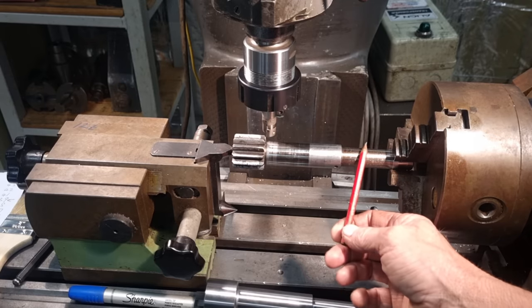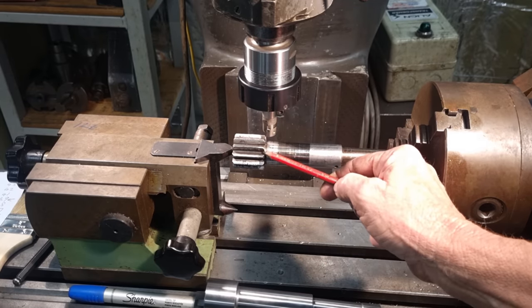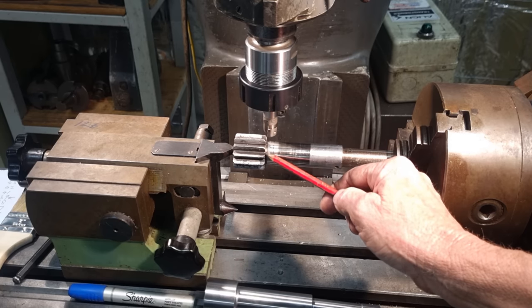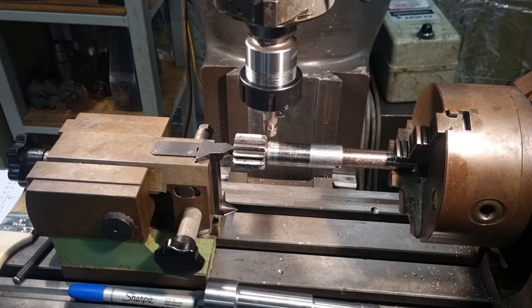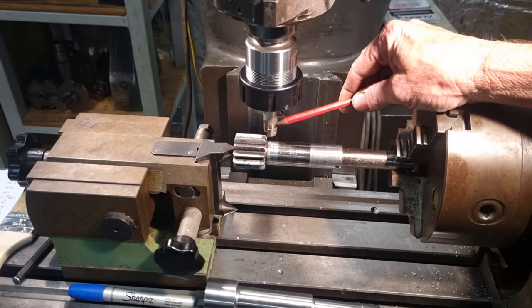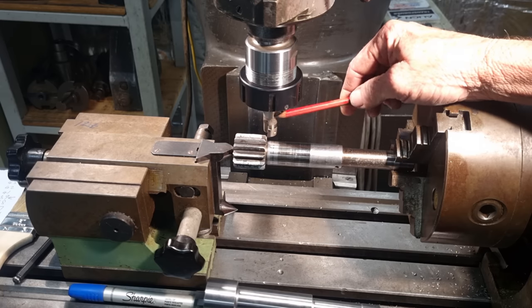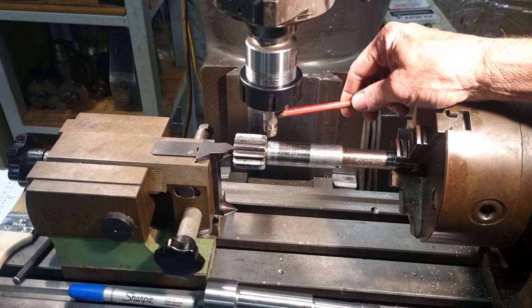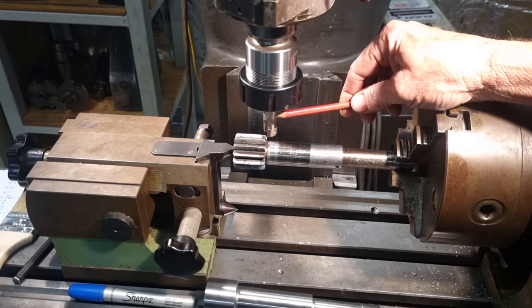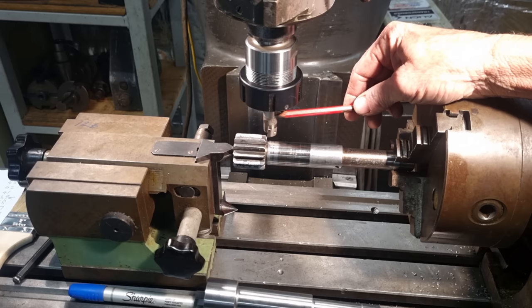So with our old shaft set up, we can position our cutter so we're taking the maximum amount of material out that we possibly can, just to ease the burden on the involute cutters. So we've opted to go for a carbide insert end mill, purely because that's my preference. Now I do have to track down a set of metric R8 collets one day, because it is my preference to hold these cutters in an R8 collet. They seem to grip them pretty well.